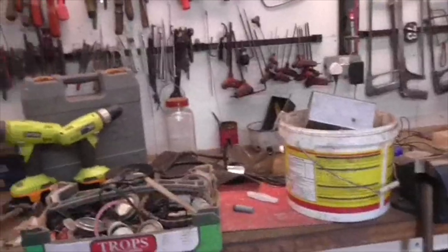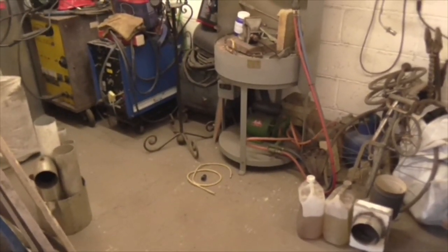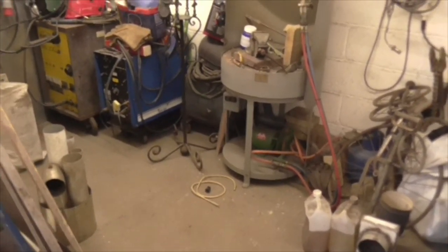Right, onward. Let's find something else to do. Let's get down on my knees and get that piece of cable put on there. Get that working again. Bye now. Well, that's it, folks. We've got a nice warm flow, a cool return. I can't begin to hazard a guess at the differential between flow and return, but it feels good to me. In other words, what that means is that the heat exchanger is losing the heat to the system, which is exactly what you want. So I'll let that go out now.